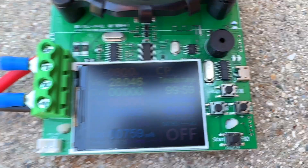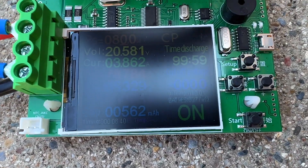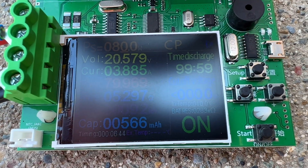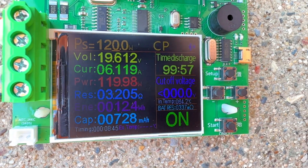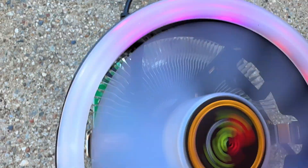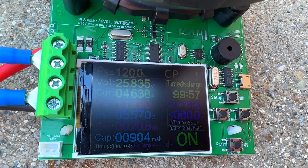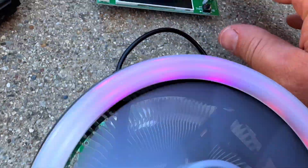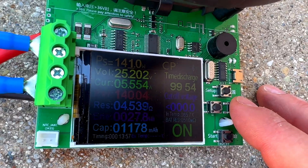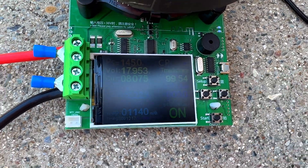Looking at the SIGS at 28 volts — turning both on and increasing load. The Renogy is reading 20.5 volts and 3.8 amps. Bumping up to 120 watts: the SIGS voltage is quite a bit higher, just as in the initial test. Going to 145 watts — the Renogy is still holding. Because we don't have optimal angles or full sun, I think we'll get about 160–170 watts max, but the Renogy is holding at 145.